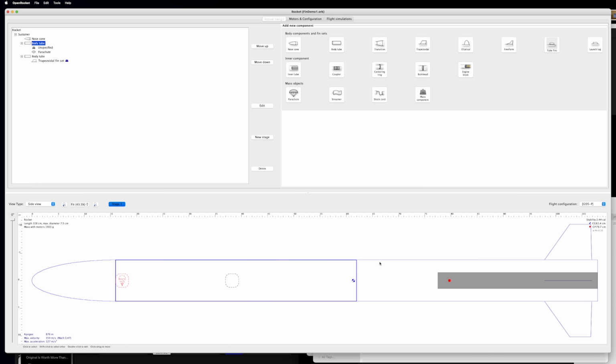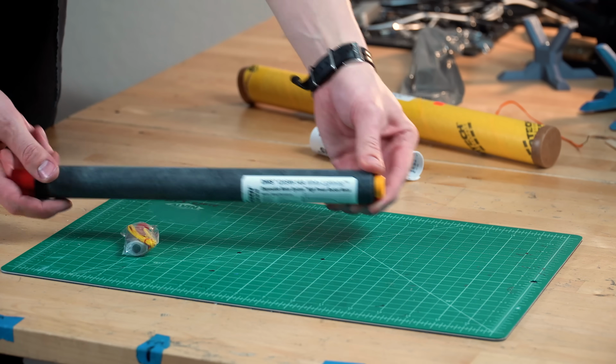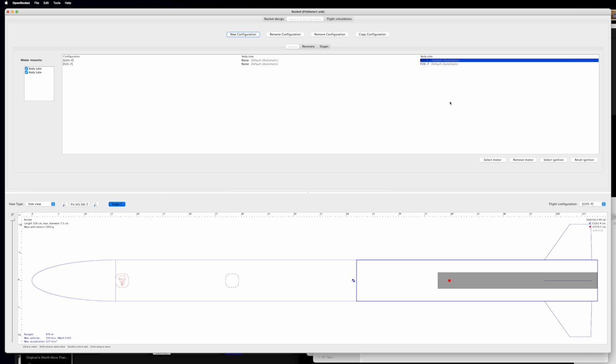Okay, so here's the OpenRocket. We've got our nose cone, our 2 body tube sections, our fins at the back, and then this is our motor. Speaking of motors, I chose an Aerotech I205 rocket motor for this first flight. That's gonna get us to about 850 meters. The sim shows us 876, but we have a ton of button head screws on this thing. The drag is way more than the sim thinks it is.